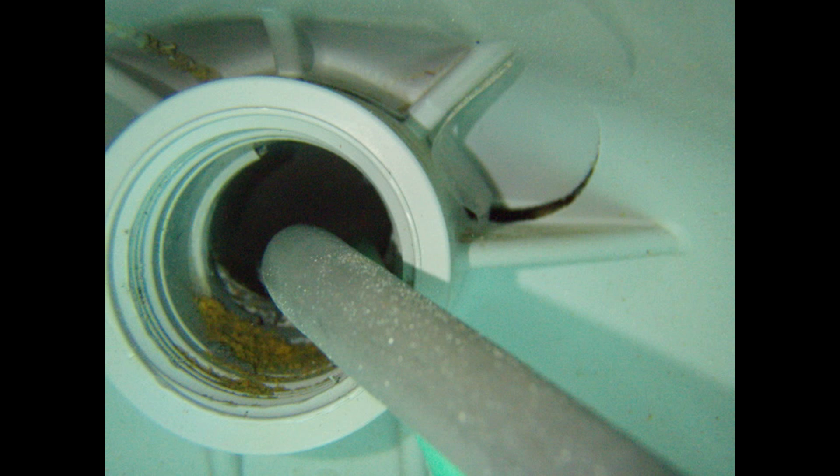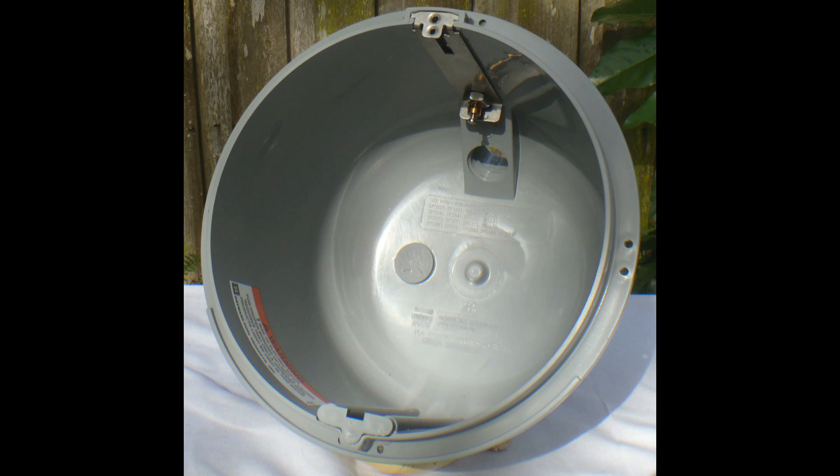Most of the different styles of plastic light housings crack like this, but the biggest offender and hardest to fix seems to be the model with the big star bolt in the conduit. If you see the big star bolt, use a flashlight and look carefully for the beginnings of a crack behind the recess of the star bolt — this small crack is just going to get bigger. As you gain experience with these light housings, you'll notice that one never seems to crack: the Hayward with the rectangular reinforcement on the back. If the housing gets too much stress, the light will break in the conduit, so patch the conduit with quick-set epoxy whether you can tell it's leaking or not.